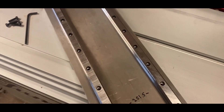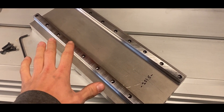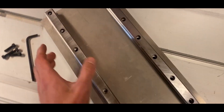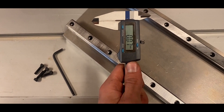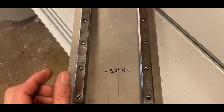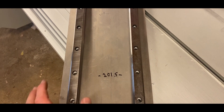These are the components for the up-and-down movement of the spindle motor. This is the back side of the plate where the motor sits at the front. There's no way for me to get this distance set correctly with just a caliper — the rails need to be exactly 161.2 millimeters outer spacing and it's critical to get this just right; they need to be accurate to a tenth of a millimeter or even less, or else it could bind.